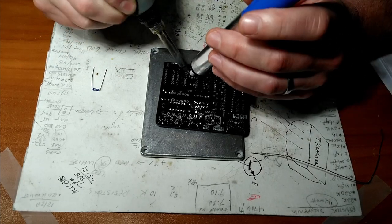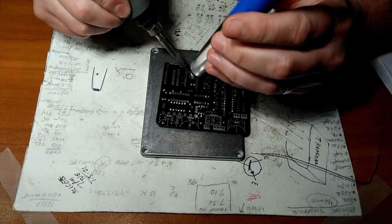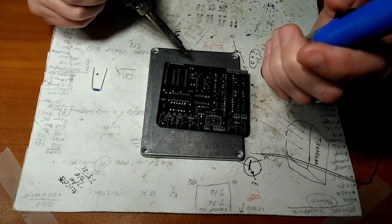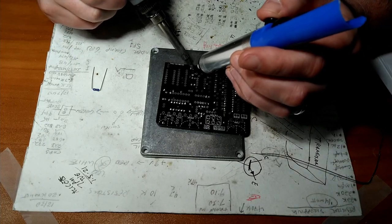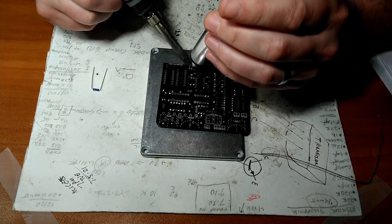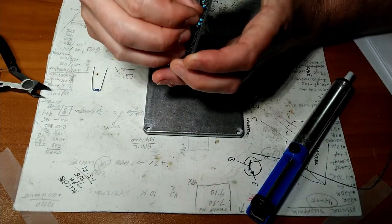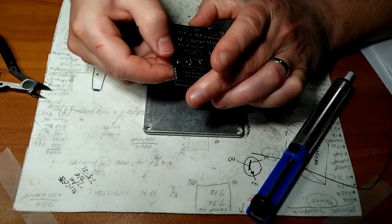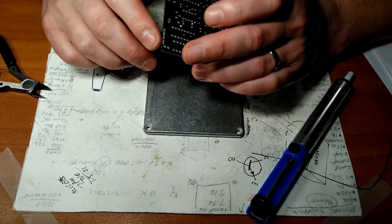And melt, stick your tip over there. Nope, not fast enough, try again. And there you have it. Sucks the solder right off. Let's do the other side now. This guy might be tough. Almost got it. That should be pretty close. Let's see how we did. Yeah, she's a little tough because this is the second time this thing's been soldered in there, so she's in there tough.